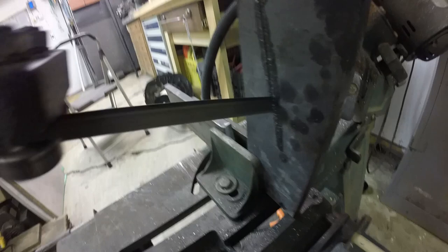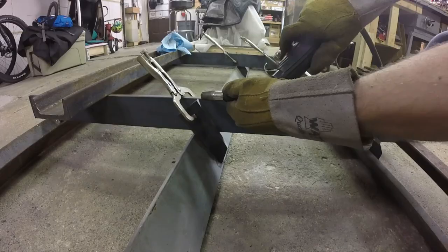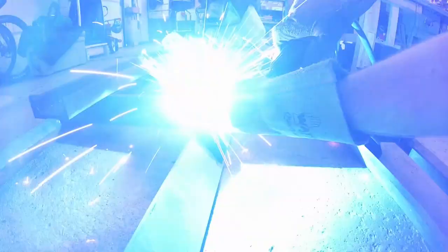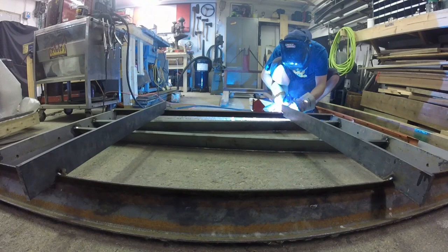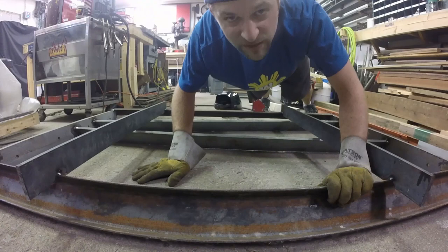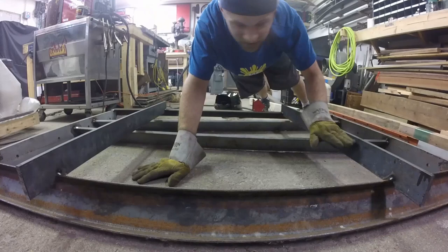Using the metal bandsaw, I ripped a couple pieces at a diagonal so that I could reinforce and connect the side supports to the blades. I'm no farm boy, but one word of advice when you're dealing with tractor stuff: don't make the clearances too tight. Make sure there's lots of room for your forks to go in, because it's guaranteed something's gonna get bent.